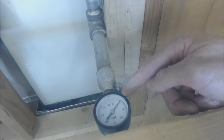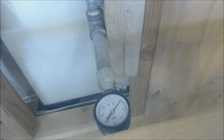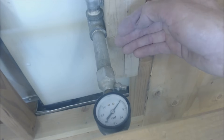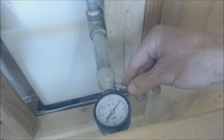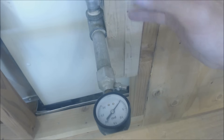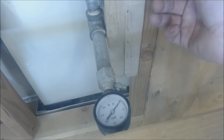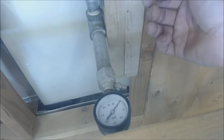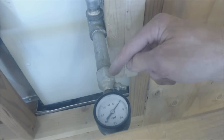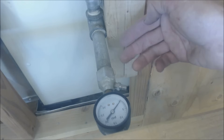So there are three reasons why I run it at about six PSIG — you could run it at six and a half or similar. When the inspector comes to inspect a gas line, they're going to press on the needle at the Schrader valve and see if the pressure goes down. This is an intact gas line piped through the whole building to wherever there will be an appliance — a water heater, furnace, dryer, range, anything like that. It's all pressure tested ahead of time, and if it holds pressure, you don't have any leaks.